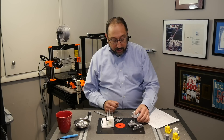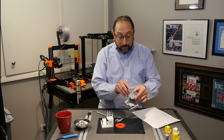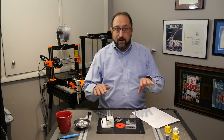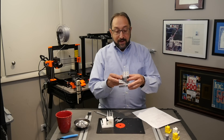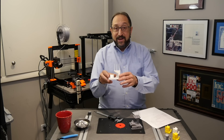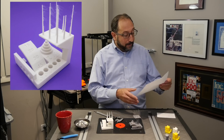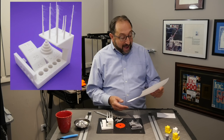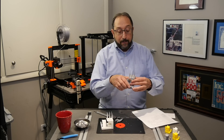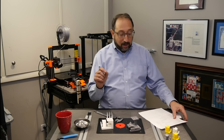The next category is fine print control, where you look at the overall height of the very fine towers. Both printers printed every tower to their maximum height — I inadvertently broke a couple off. The primary difference was stringing: there was very, very little stringing on the Prusa print, and a lot of stringing on the Ender print. They were both printed at the exact same temperature, so that's a meaningful difference. The Ender rated 2.5 points and the MK3 five points — nearly perfect — which is remarkable. Part of that may be due to using Simplify3D, which does a very good job on fine points during slicing.